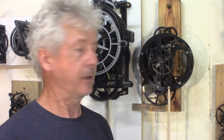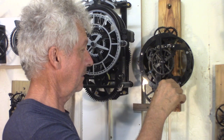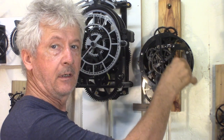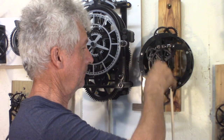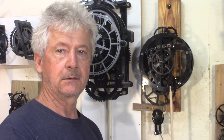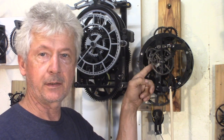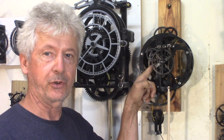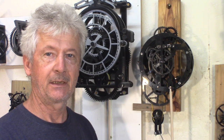Just like some other clocks I've done, it also has a maintain power spring back here. So when I go to rewind, the top keeps sticking. There are still some issues I need to work on. The longest it has run is five days, and I think there's some binding somewhere in here. I need to push the ratchet gear back and it starts again.